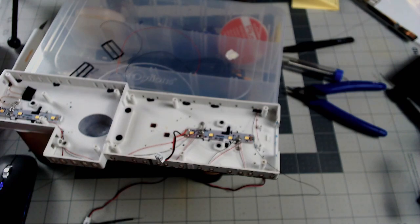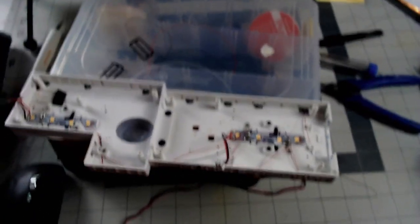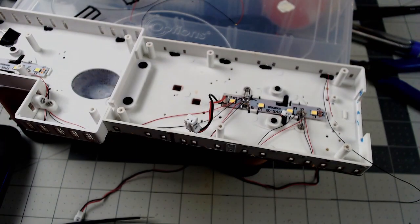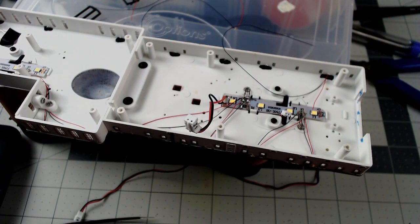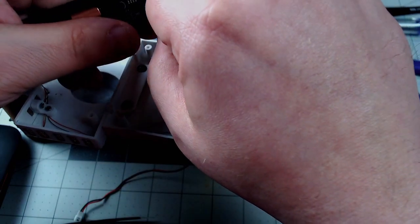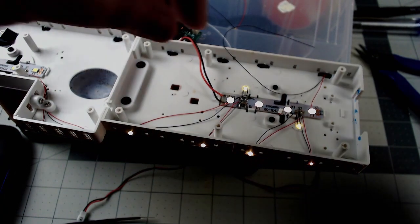Now we're going to want our eyes, and we're going to want our soldering iron here. Some more light over here. Okay, now, step one is we're going to connect the positive to the positive. If you've got enough solder on there already, you could do this pretty easily. I find that one of the best things you can do just to make sure you're not screwing anything else up is to keep these plugged in, because then you can actually see the lights that you've already installed and make sure that nothing's not working.